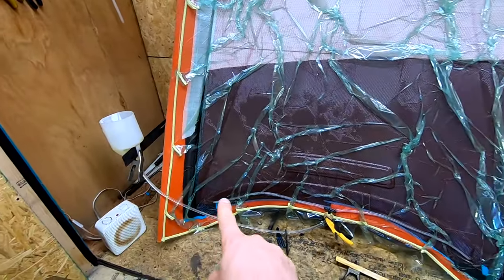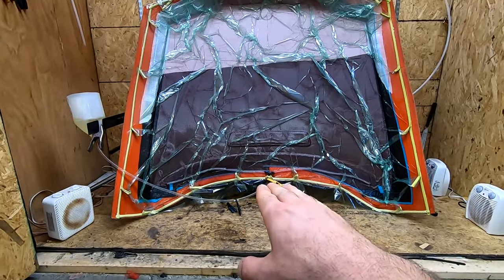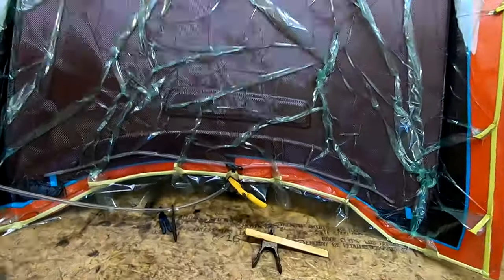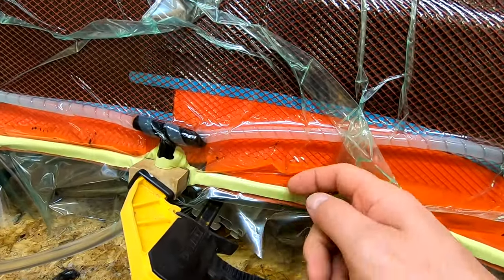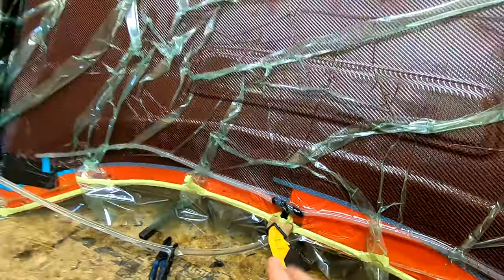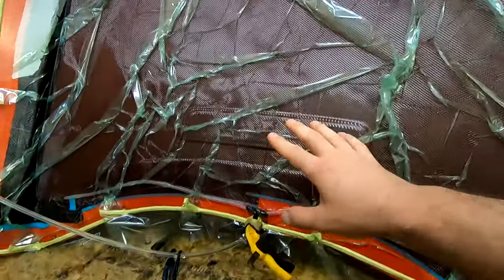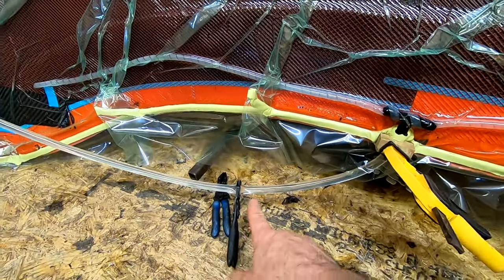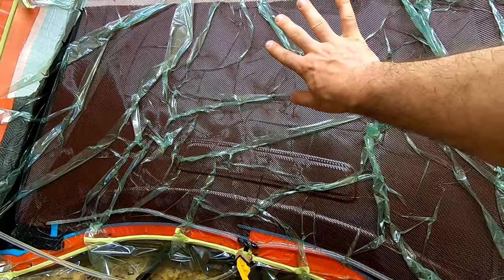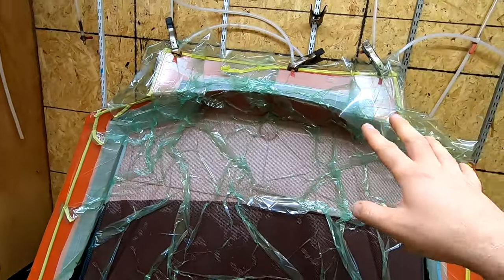One negative, in a situation like this where the mold inlet is lower, so if we come down, you can see how the inlet is lower than the cup, and you'll get what's called ballooning. And ballooning is, as you can see how we're getting a buildup of epoxy in the bag? So it's filling up like a balloon because just the weight of the gravity is pushing it in faster than it can flow through the whole part. So pretty simple. Pinched it off, let it suck this down because that epoxy will obviously still make it into the part. I just had it open a little bit too much. I need to slow down the infusion. Otherwise, it's a pretty standard infusion.